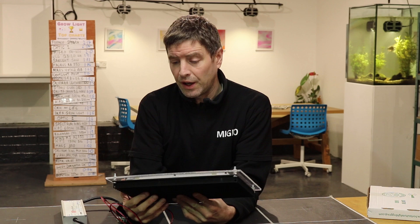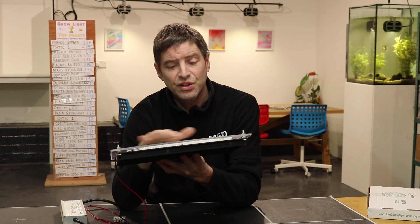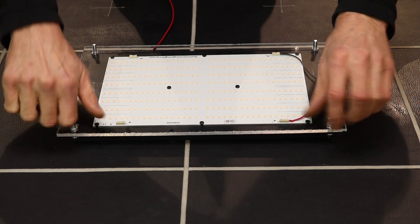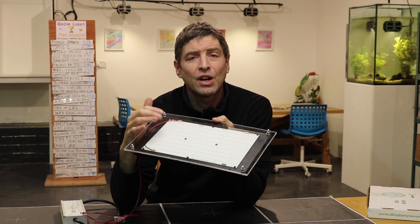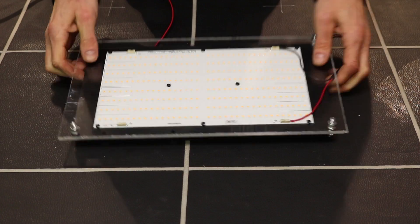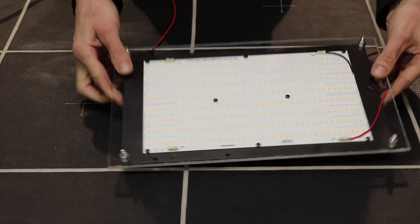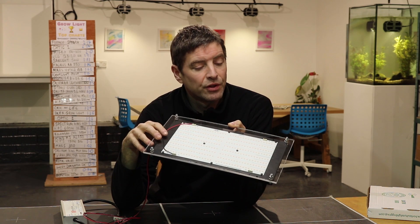It's recommended for protection of the LEDs to add a piece of clear acrylic sheet plastic onto the front cover. That just protects the LEDs from scratching, water, or dirt. If any particulates land on the surface of the LEDs while they're illuminating, it causes a hot spot and will burn them out. So it's wise to have a cover — that's what I've done in any case.